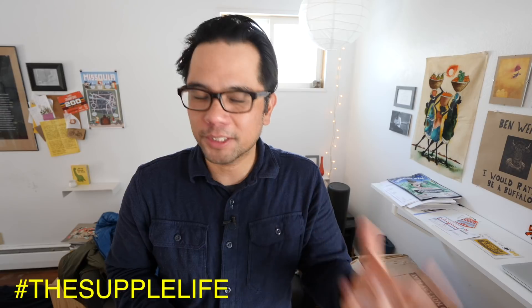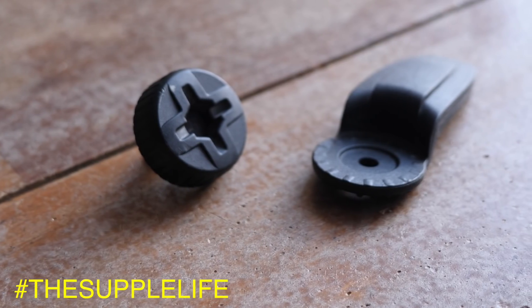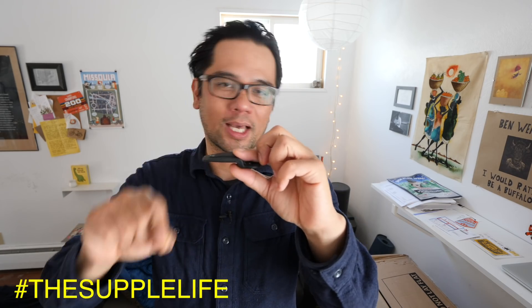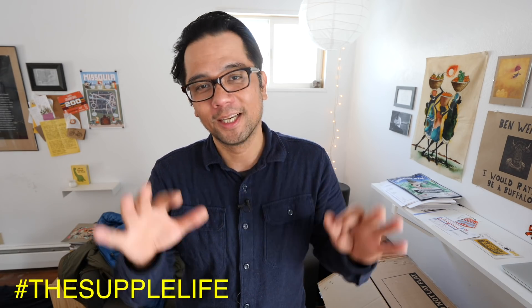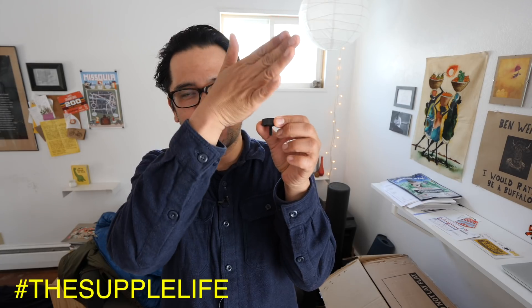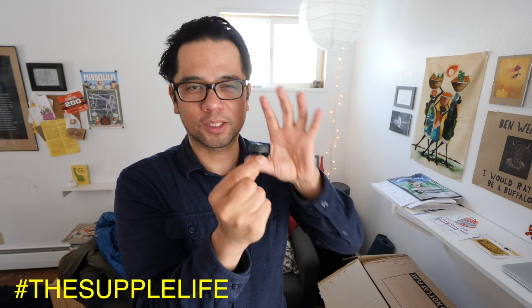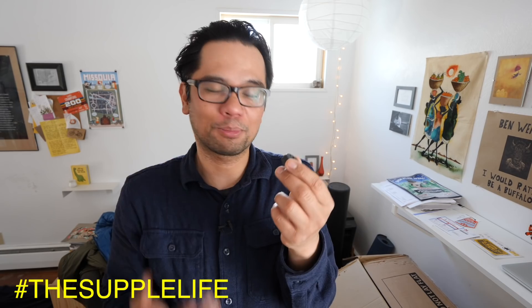I knew I wanted to create a non-destructive system — something I could easily remove and put the OEM parts back on in case it didn't work out. So instead of something completely new and different, I was just going to modify the pieces they already had. Instead of a hook, I wanted to create something with a slot that would anchor the elastic strap. And even though they were super simple shapes, because it was my first time getting used to the software, it took way longer to pull off. Probably one of the trickier bits was I knew I wanted some kind of knurling on the knob so it wasn't a smooth cylinder. So I had to define a space, draw a cutout, and then create a circular pattern. I knew how to do it conceptually, but I had to learn how the program wanted me to input things — that knurling took like hours. It was pretty ridiculous.